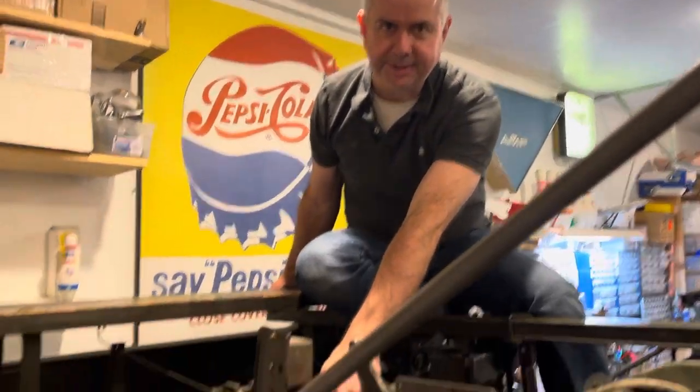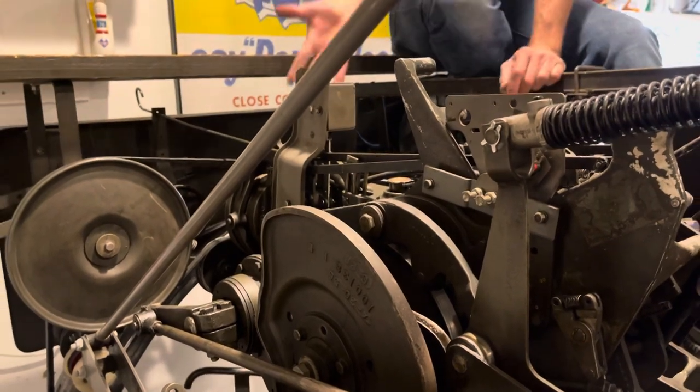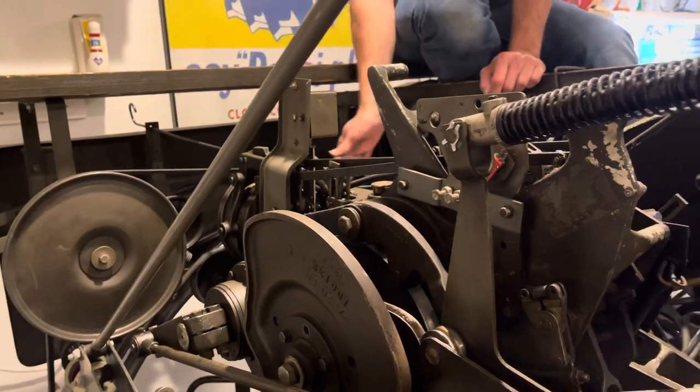What I'm going to do first is engage the clutch and then crank it backwards on the main gearbox drive belt. You go from the 10-pin toward the 7-pin, and that will reverse the movement of the deck.